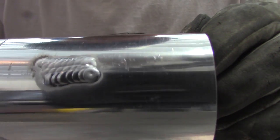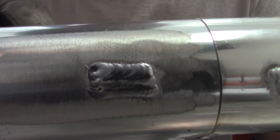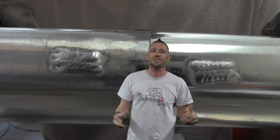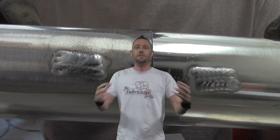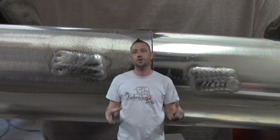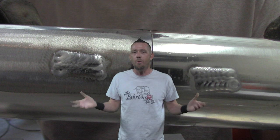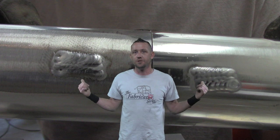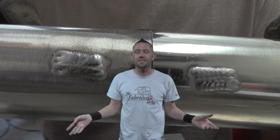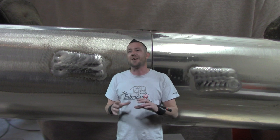Now aside from the results, notice that on the Verified Metal we're good, clean, neat, and even, but on the Mystery Metal we've actually got a problem. There are a lot of contaminants, a lot of junk, a lot of things that start popping up and floating to the surface even though we prepped it. This is part of what adds to the general frustration of working with Mystery Metal — you didn't suddenly become a bad welder, but these results show something totally different. Even though you prepped it and went through everything, you still get a lesser-than-average weld out of it.